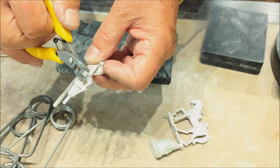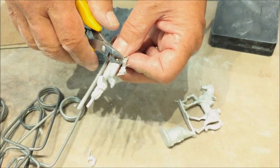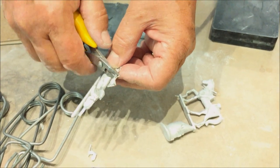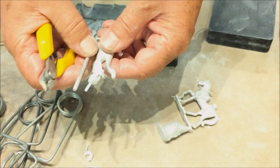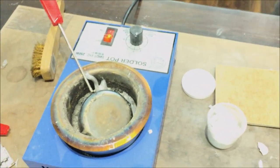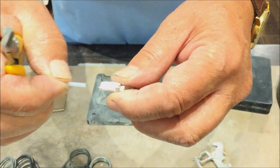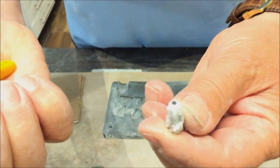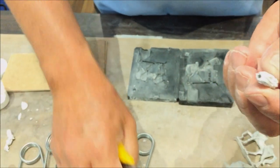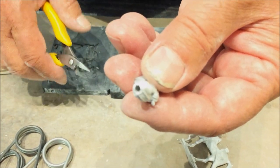Next, remove the ingates with the super snipper. Cut off the heads, arms, weapons and body from the larger ingate. The ingate and any other waste parts can then go back into the solder pot basin for reuse. Take out the PTFE rod from the body section and keep it safe for reuse.